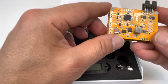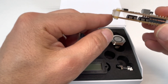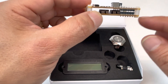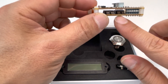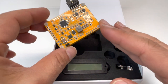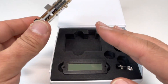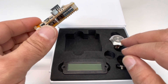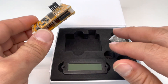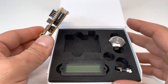This is firmware operated, it's completely digital. On the bottom, the load is completely separate from the brains. This patent-pending feature allows you to increase the amount of FETs for your particular application. This particular setup can operate from up to 60 volts. With this load board, 60 amps continuous. And if you add a different load board — 120 amps — if you stack more, you can really increase the amount of current that you can pass through the switch.